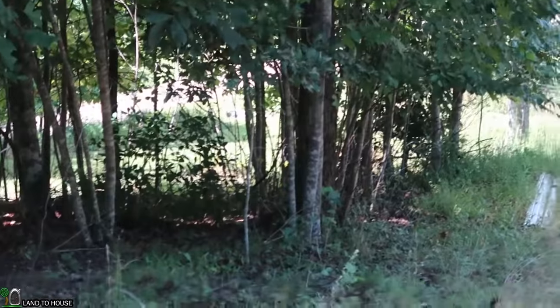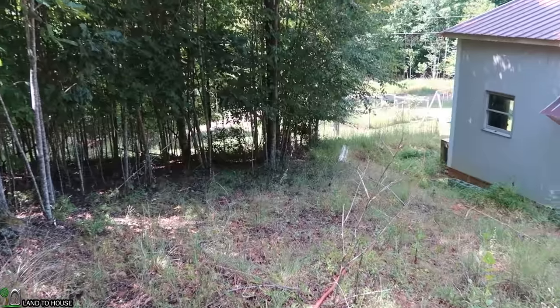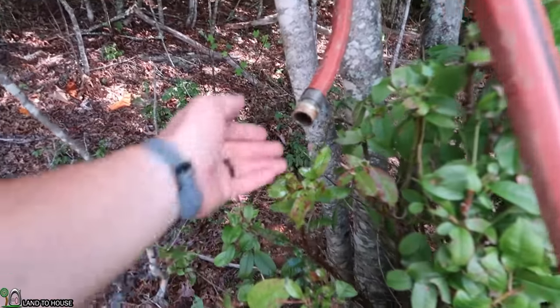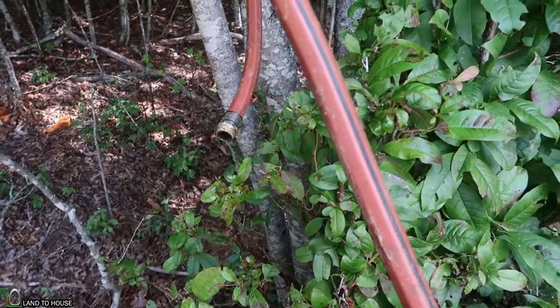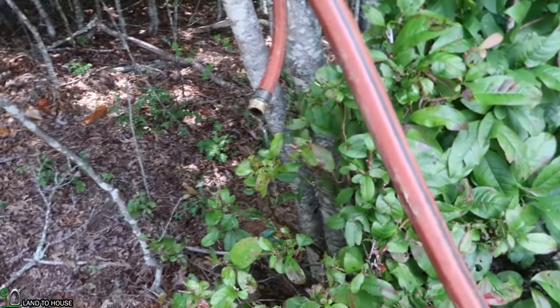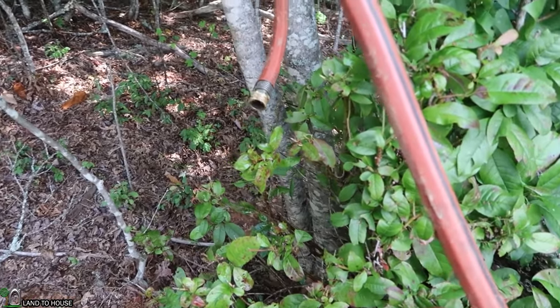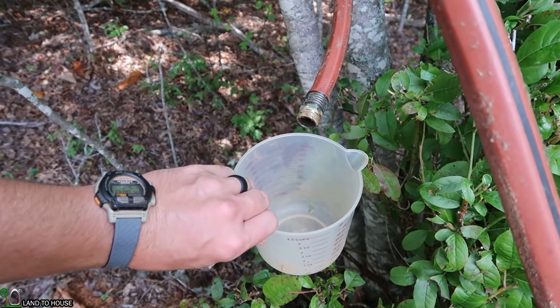I'm not sure you can see the pump very well, but right between here at the road is where the pump is, and this is where we are going to. We are still getting a trickle up here, which is cool but frustrating for the test. So I'm just going to consider this good enough. Let's take a flow rate measurement: 30 seconds on the timer so we won't be sitting here forever. I'm a little bit concerned about my storage tanks running out since the other ram pump is turned off today.